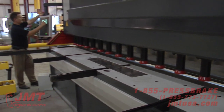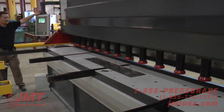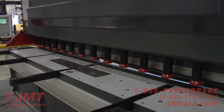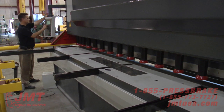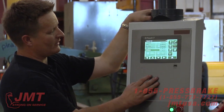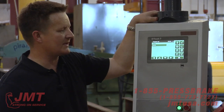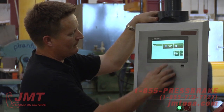Back to single stroke — a guy walks up, aluminum, change my thickness to 0.02. The back gauge goes back to our program position, rake angle changes. There's our half degree rake angle on our 0.02 blade gap because of the material I changed. I go to my home screen. I've got saved programs, calibration, and my material list. I can develop a whole product list or material list, plus a program list with all my programs. I can save them and pull them up for later use — say you've got a particular product or a kit out of a sheet, trying to get sheet utilization, you can pull up that program and run it. It's a very nice machine.